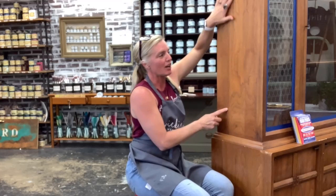So, what I did was, I did kind of prep this. I already cleaned it with the White Lightning. Dixie Belle has an awesome powder cleaner. Comes in an 8-ounce container. Pick it up from any of your local retailers. And you wash your piece down. You want to get up all the grime and oils and maybe some Pledge or whatever's on there. You want to clean your piece. Now, silk being a different beast than the chalk mineral paint, you also are going to need to give it a scuff sand. Yes. Every piece you paint with silk, you should use a scuff sand.